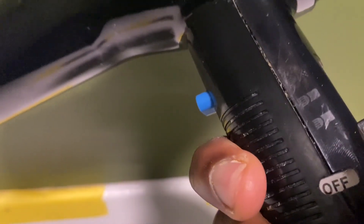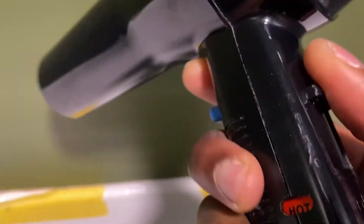Whilst the sealant is still soft, get the masking tape off. Paint peeling comes with the territory, so just repeat the rework process — use your scraper's knife, take out the scrap bits, use your sandpaper, clean with a microfiber cloth, and paint over again. I've reworked it and painted over the imperfections. Wherever I've got imperfections after paint removal, I keep using the tapes until I'm satisfied that I've got a crisp, fine line. There's no telling what you're going to find behind the tape, even if you're taking it up at 45 degrees. I'll speed up the drying process lightly with the hairdryer and subsequently take the remainder of the tapes off the sealant to see if the imperfections are still there.